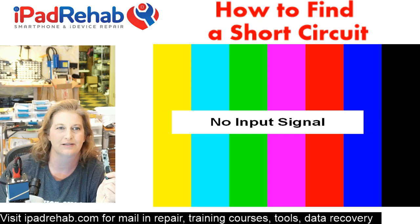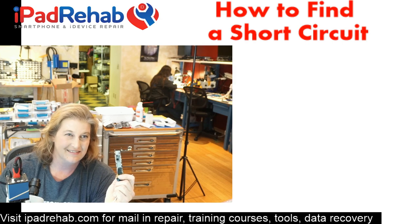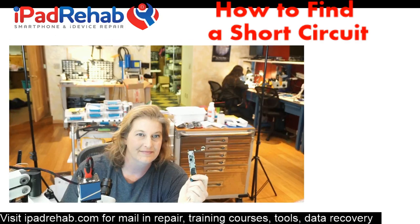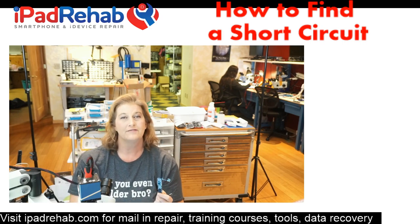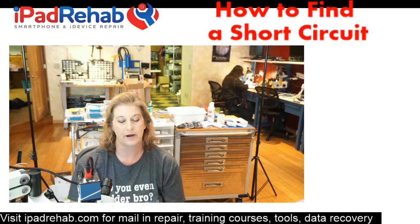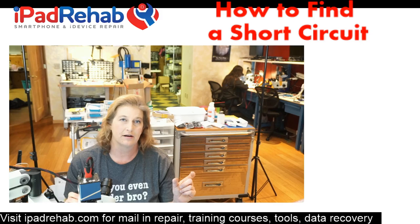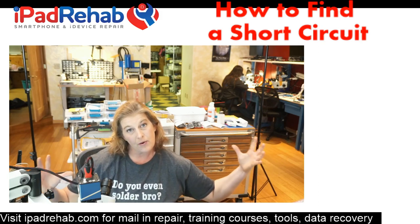The exact ball is what really helped us. Let's just move this over. Let's give up on that. It was the precision to be able to identify the exact ball on the, why does that say locked? I didn't lock that. Unlock. There we go. The exact ball led us to figuring out that the actual short was on the 1V8 touch line. From there, we looked around at it in ZXW, but made sure to not get trolled by the fact that ZXW doesn't show you the whole line if the line goes through a filter, which is a wire, or a zero ohm resistor, which is a wire. That means the line is going to continue on to other branches that are really all part of your line.